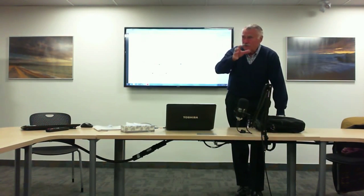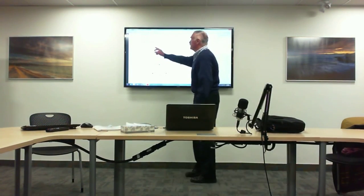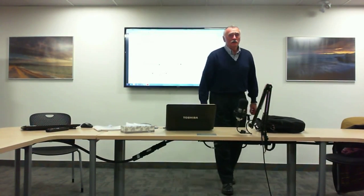Now the 3.5 megahertz from the antenna is mixing with the 3.5 megahertz of the super regenerative radio called the autodyne, and there is a small difference in frequency. You detune the two by tuning your variable capacitor, and the small difference would be the audio that you hear. This has kind of historical importance because no one would sell you an autodyne. You can go to any ham radio store in the world and ask them if they have an autodyne radio for sale. They would just probably say, what's that? But somebody put it in your curriculum.